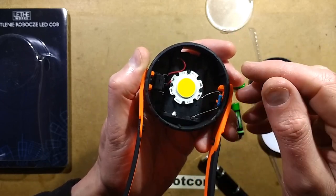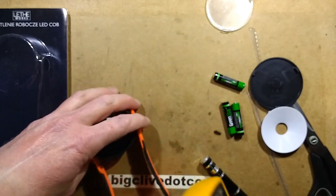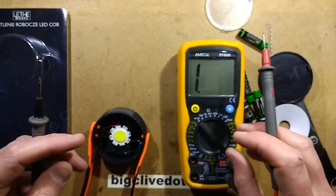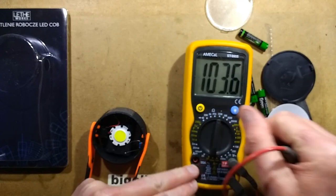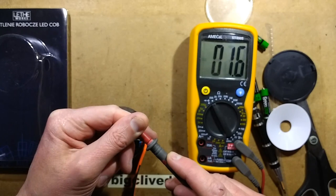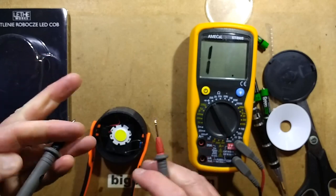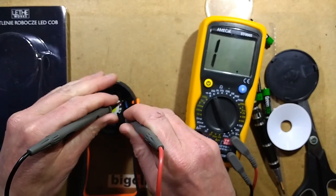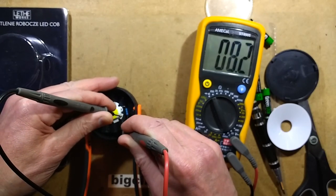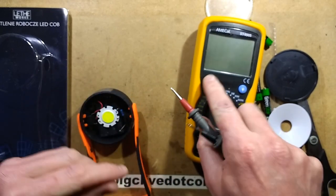This array of parallel LEDs - let's see if we can measure it. It's quite hard measuring low value resistances with generic meters, but let's stick this to the 200 ohm position. The leads are already about 1.8 ohms, let's say about 2 ohms. So as long as I get somewhere around the 4 ohm mark then I'm correct. That'll do - yeah, it's 2.2 ohms. That's just absolutely fine.